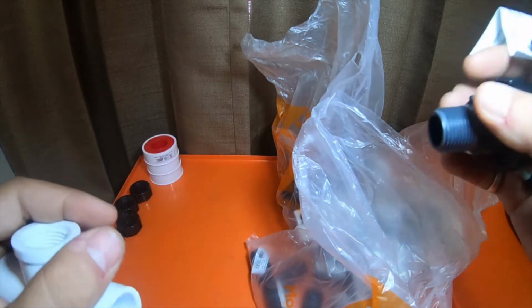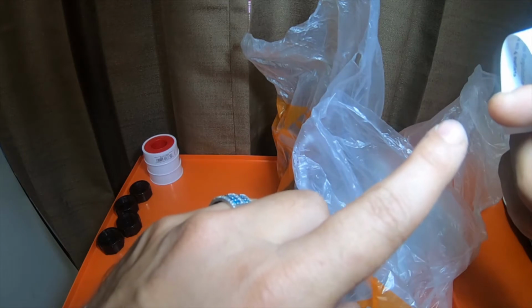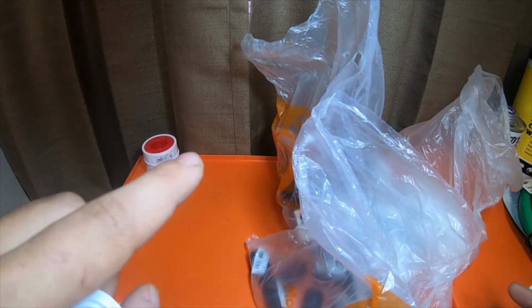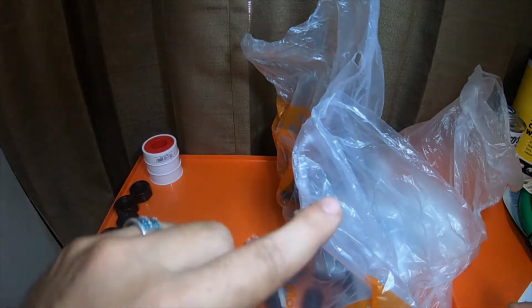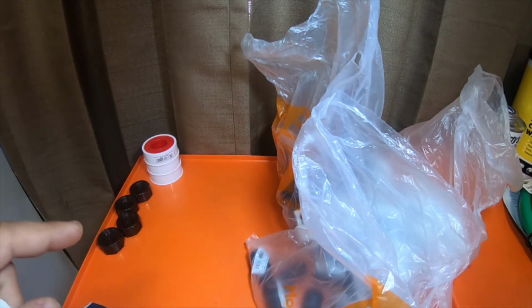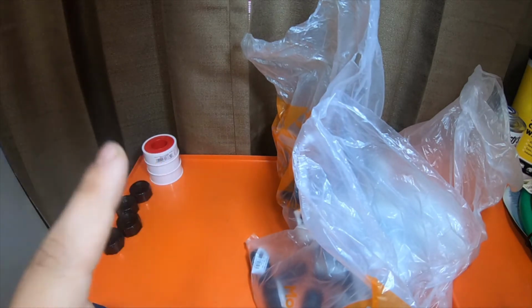So if you do it that way, it's technically the drip or spray nozzle, one item, the hose, the 1/4 inch dripping hose tubing here. Then at the other end, it's a barb fitting that you poke into the 1/2 inch irrigation tubing that plugs into that little hose. So it's 1, 2, 3. The 1/2 inch irrigation hose is the 4th item. Then Shark Bite fitting to a 1/2 inch thread, pipe thread, is the 5th item.